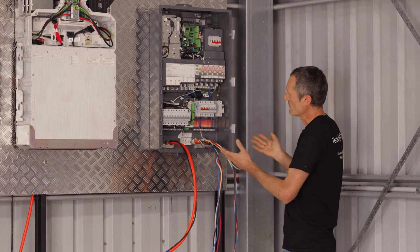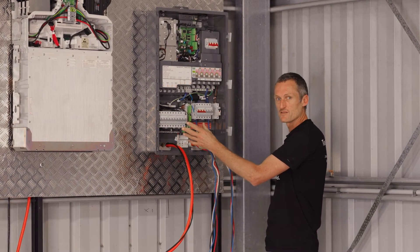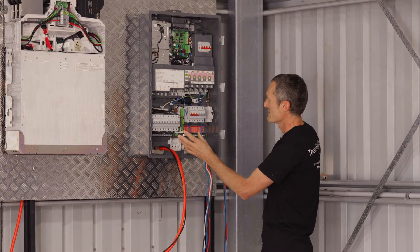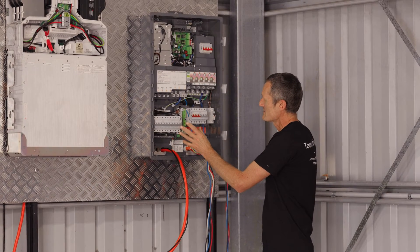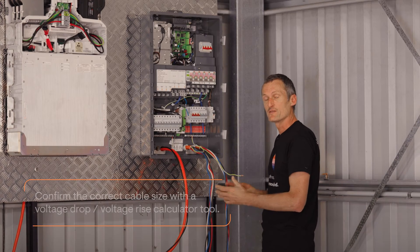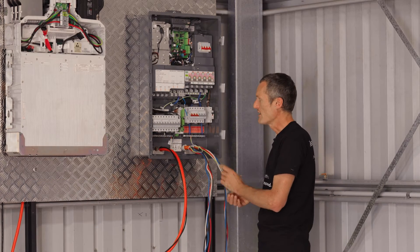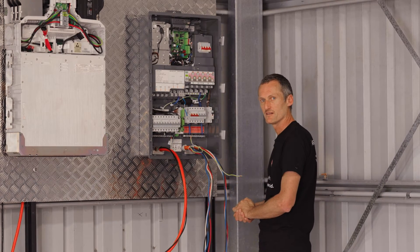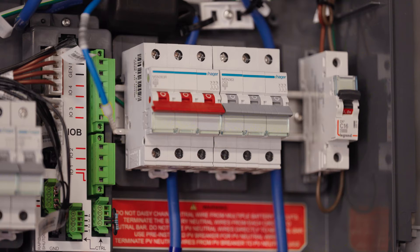Part way through the wiring, we can see what's happening inside the IQ system controller. On the left-hand side, the solar circuits have landed from the roof — three three-phase circuits wired into the system controller. The system controller also has the battery connection: the batteries will be connected on one phase, two batteries in that circuit, connected with one 10-square-millimetre AC cable back directly to a single-pole circuit breaker at the switchboard. On the right, the AC mains from the grid come into the system controller, and as it's an 80-amp system controller we've got a lot of flexibility in cable sizing and circuit breakers.